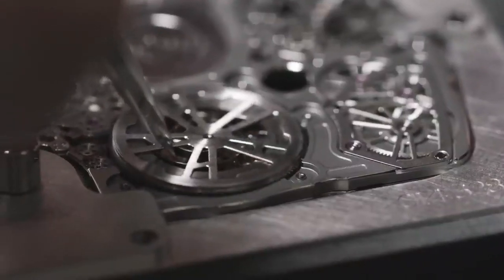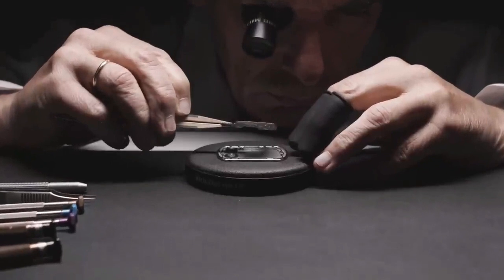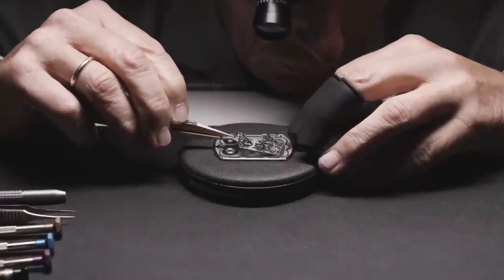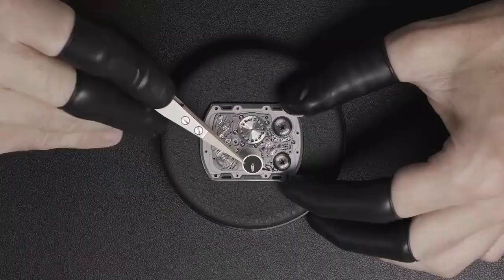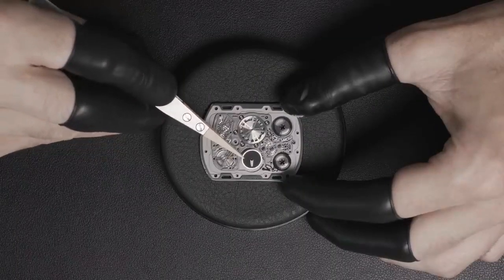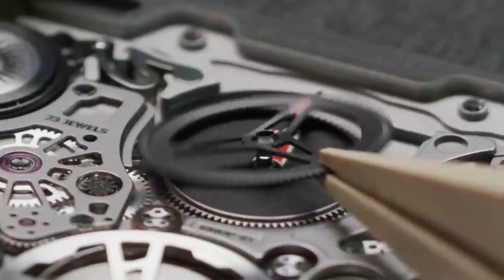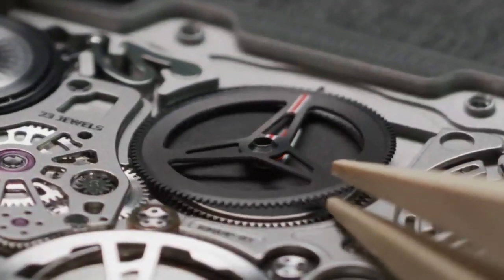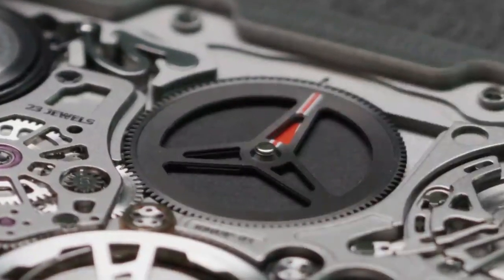Fast rotating barrel: 6 hours per revolution instead of 7.5 hours. This type of barrel provides the following advantages. The phenomenon of periodic internal mainspring adhesions is significantly diminished, thereby increasing performance. An excellent mainspring delta curve with an ideal power reserve, performance and regularity ratio.